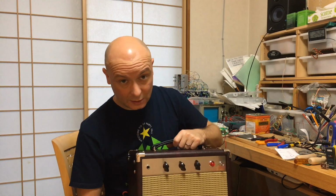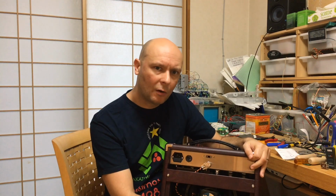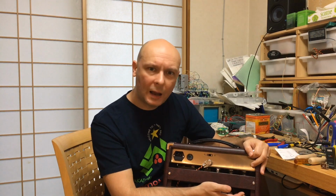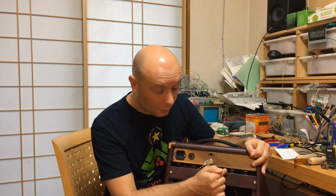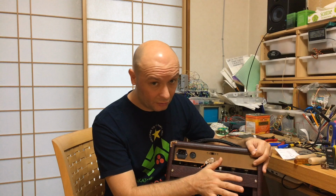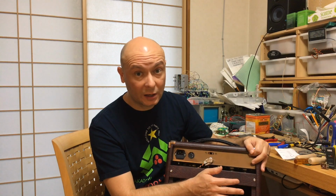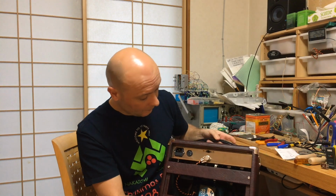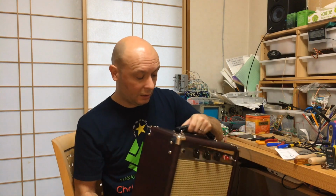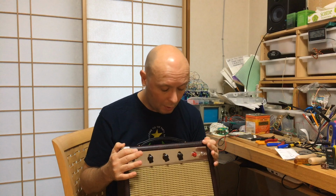The power tube, as I mentioned, is available on the NOS market, like the preamp tube, which are 12BH7. It's a great tube and way cheaper than an equivalent 12AX7, which is most commonly used in other guitar amplifiers. So today I'm gonna take you on a tour of this small combo amp.